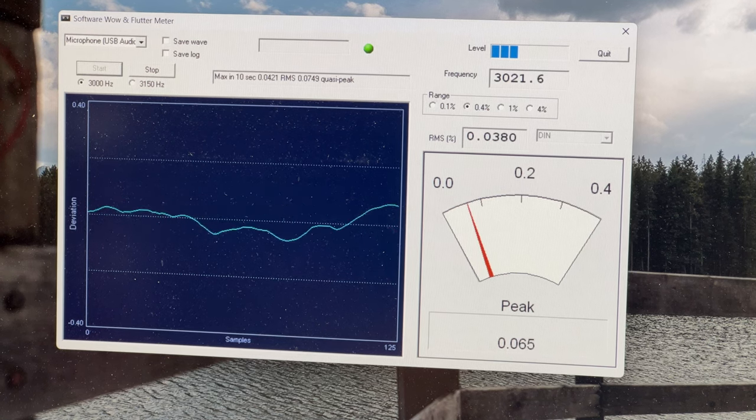Let me get some more acetone going here. Sometimes these patches of old circuit glue are too blackened to respond very well to acetone, so you can use heat as well, but just be careful with that approach, because if you've got a hot air rework station like mine and you're blasting heat at a board, that could lead to bad things. So anyway, I've got access to that now, so I will continue on with my endeavor here.